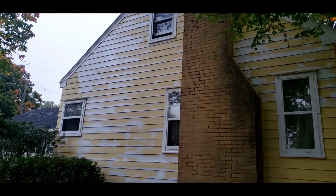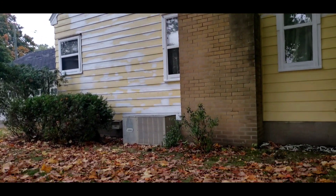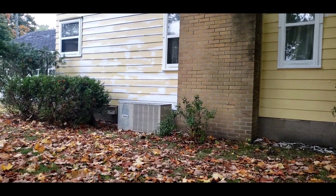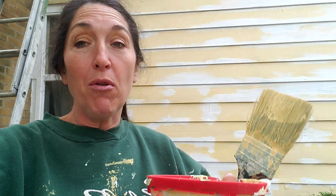Hopefully I'll be back at this tomorrow, and I've been getting some ideas about a lime wash on this brick. Since the porch awning is going to stay temporarily, maybe I'll give it a fresh coat of tan or gray paint just to make it blend in a little bit with the cement blocks. When I started this video, I was hoping to get the front painted on Sunday and the side on Monday, but the help was weak. The weather turned bad and I wasn't able to get the side of the house painted, so I'm in primer over there. I had decided it was better to get that primer on the bare wood quickly rather than trying to get a second coat of paint.